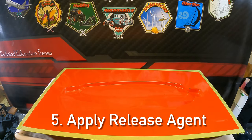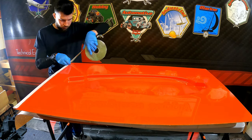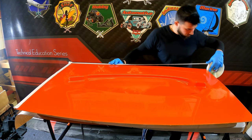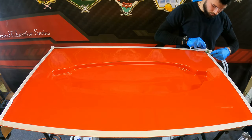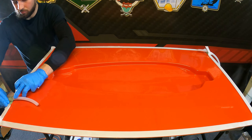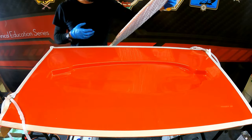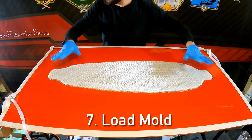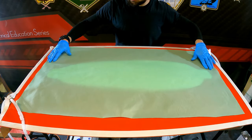Apply some release agent to the mold and make sure it's released. Believe it or not, we have had people try it without release agent and it did not end pretty. Next we're going to apply the sealant tape. He's twisting it at the corners — I tend to tear it off and overlap, but you can do it however you want. We apply the sealant tape at this point because if you drop a fiber over the line where the sealant tape is, when you remove the paper it'll come off with it. He's also pre-installed his vacuum outline and his resin feed line, running through the perimeter tape. We also have connectors that allow you to connect through the bag — there are a number of ways to do it.